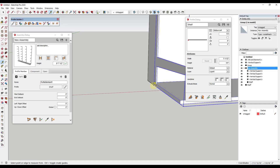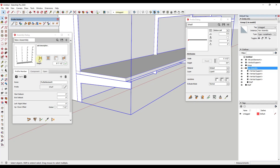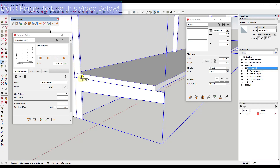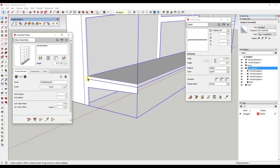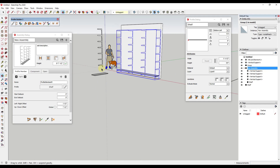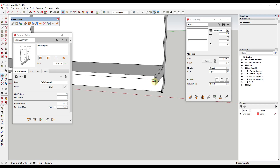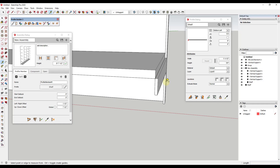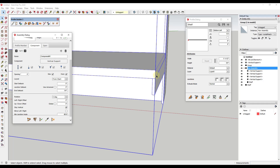There are a few things that need fixing. First, we need to move the shelf up so it sits on the support piece, so we set our up/down offset to seven and a half inches — type in 7.5 and update. Next, the shelf is off on the end by a little bit, so we set our left/right offset to one and a half inches — type 1.5 and update. Notice how that's being offset out correctly. Also, the end support is overrunning by a quarter inch, so we go back into our components and set the end setback to a quarter inch, then update to get the proper placement.